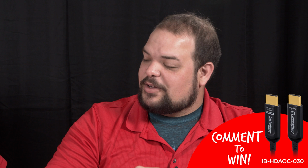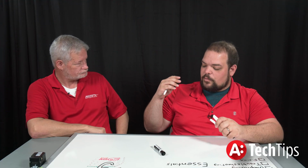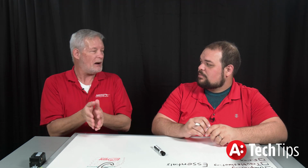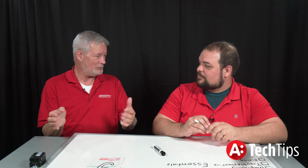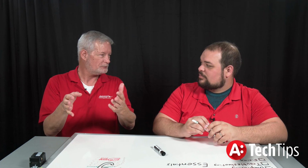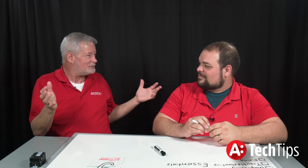So talking about diagnosing, let's talk about where we can see a grounding problem, or where we can hear it, I guess honestly, is a good spot to start. When you're looking at HDMI, because that is really the bulk of our calls, HDMI symptoms are fairly limited. I mean, there's snow, there's no picture, and then there's no picture with some kind of words on the screen. And that's kind of what we see.